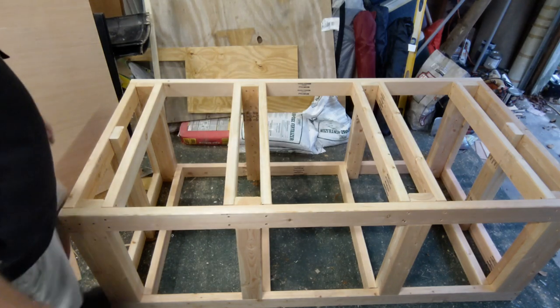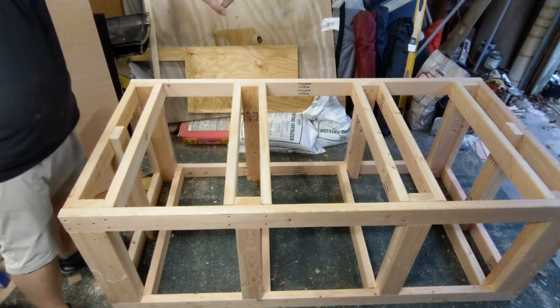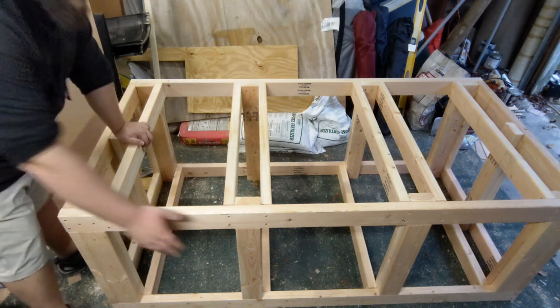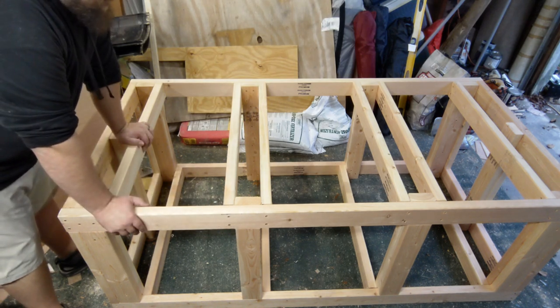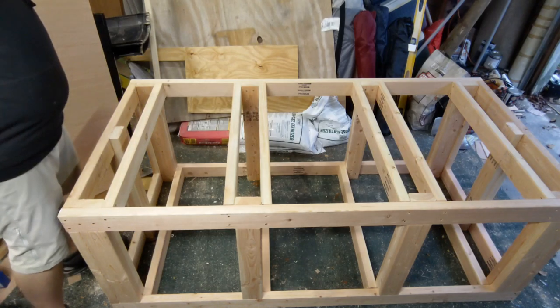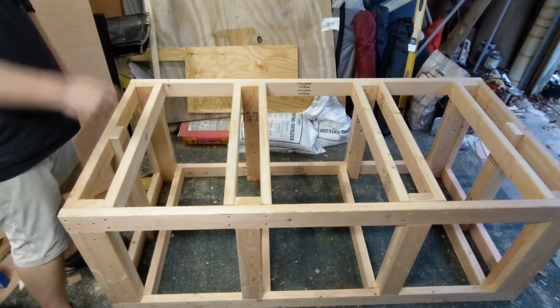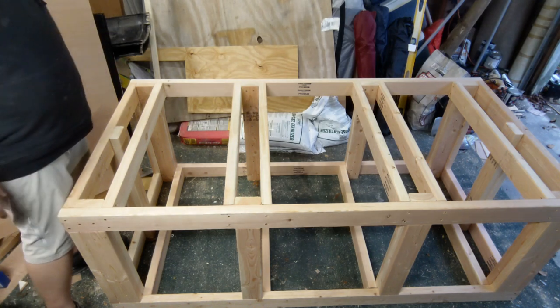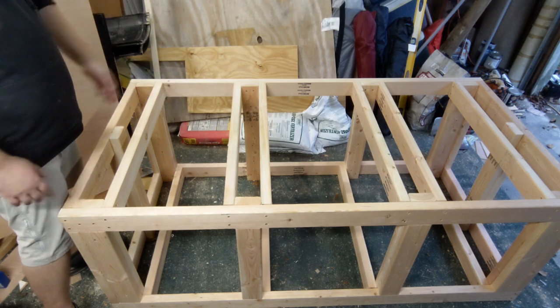The only other thing I did was add bracing on the sides — we've got vertical supports on this end and that end down there, functioning the same way as the ones on the front. So as far as vertical support goes, we've got 1, 2, 3, 4, 5, 6, 7, 8, 9, 10, 11, 12, 13, 14 total. So this stand could hold 14,000 pounds, and it's transferring that weight all the way to the floor.